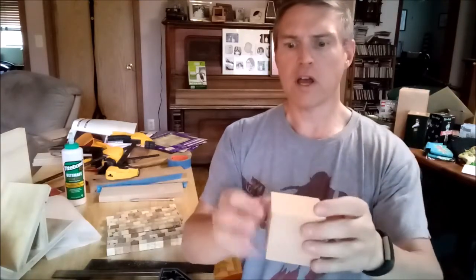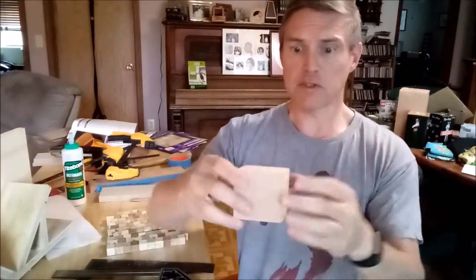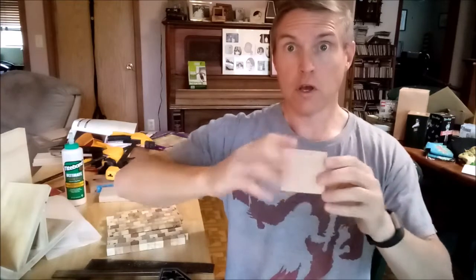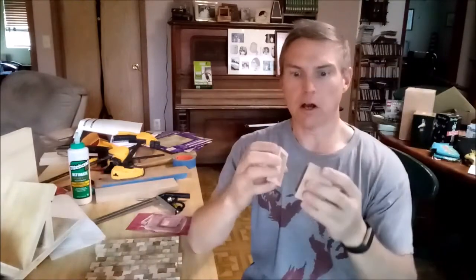So anyway, the next thing to do is go out and cut the top of this box off, and I'm going to cut it off a 1/2 inch from the edge, and that just means I'm going to set my table saw fence up and I'm just going to run the box through it like that, 2, 3, and 4, and that'll take the top of it off. And after I do that, I'll come back and show you how I'm going to work the spline miters.